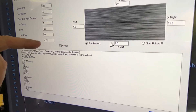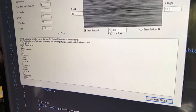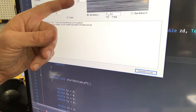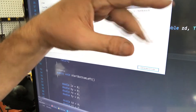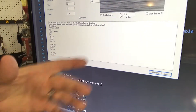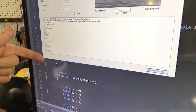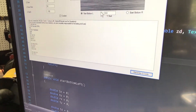You can also set clearance from moving, Z feed rate, and Z depth so you can come down and pause for like a second or whatever, then move over and come up — and whether you want coolant or not, which is probably a nice idea. You can specify the dimensions, and right now I have it set where you can start from the bottom left or bottom right depending on the engine turning pattern you want. It then automatically generates the G-code based on the size and diameter of the tool to run the engine turning process. You just copy this out and paste it into your mill and away you go.